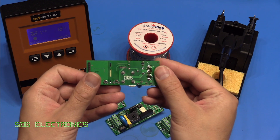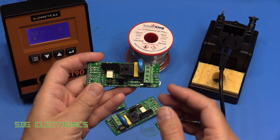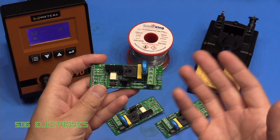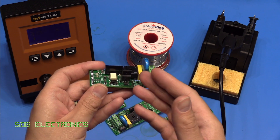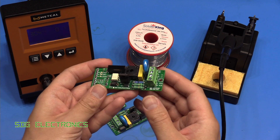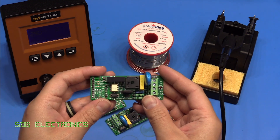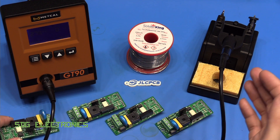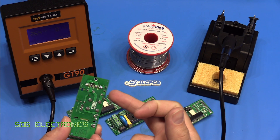I'm going to clean this up in the ultrasonic bath and then in the next video we can start connecting this up to the Picoscope, connecting it up to some lights, and see what the waveforms look like — testing how this new IGBT and bridge rectifier arrangement works instead of the dual MOSFET arrangement. In terms of the soldering, the T4 still handled all of the joints effortlessly, even the larger ones.